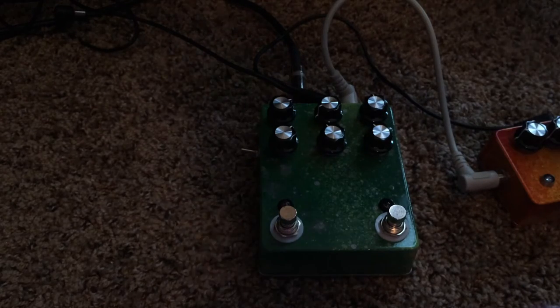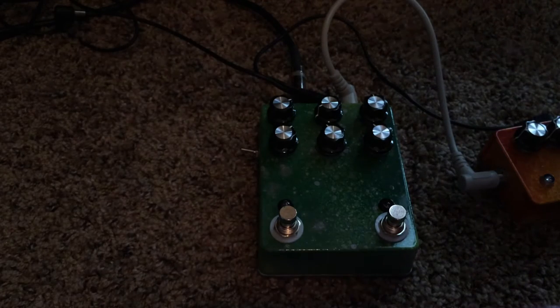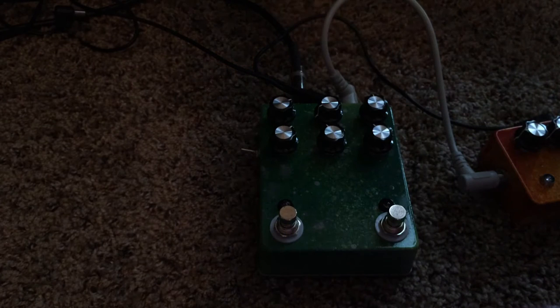Here's a little megalith I put together. I had a little switch on there so you can switch from the LED to the Germanium-style clipper. It definitely gives you a little more range of tones. I actually like it a little bit better with that type of diode, so I made it switchable so you can still get the stock style settings.